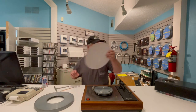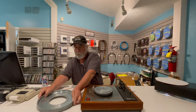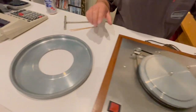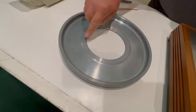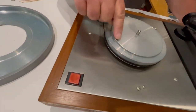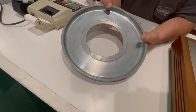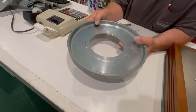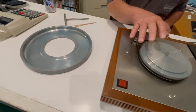One of the most critical parts is where the platter itself meets the inner platter. The platter is lacquered top and bottom, but this mating surface is not lacquered, nor is the inner platter's mating surface. Under the light you'll see fingerprints, because people decided to hold it and carry it that way. The finger oils have started to cause all sorts of problems on the surface, which means its coupling to the inner platter is being undermined.